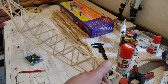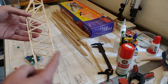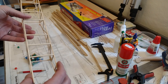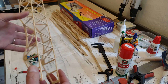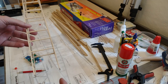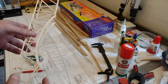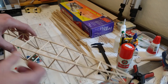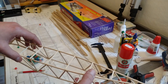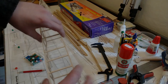It's quite a big structure — I'm always fascinated that just sticks and a little bit of glue have quite a lot of rigidity. If I try to bend it, it does bend a little but not too much. On top of this then we have the formers which will give the shape. The next step is probably to do the nose part and the battery hatch, and I also have to figure out where the battery, motor, ESC, and servos are going to sit.